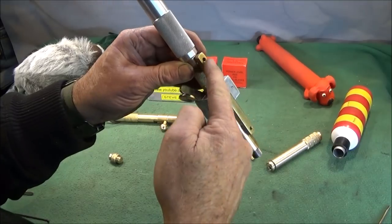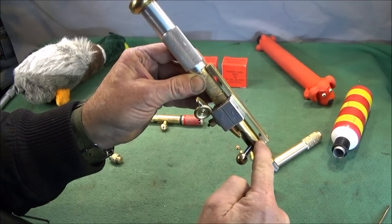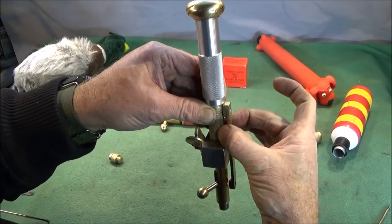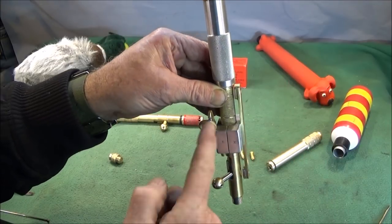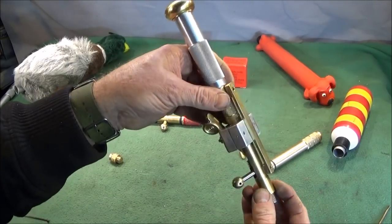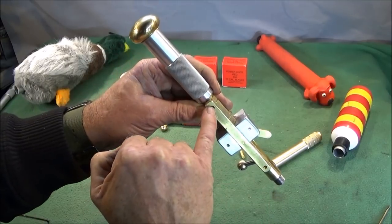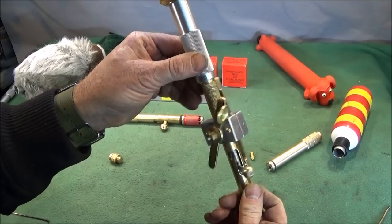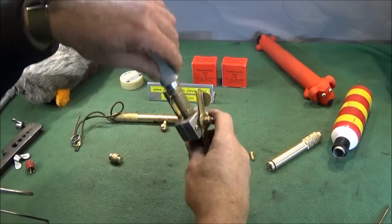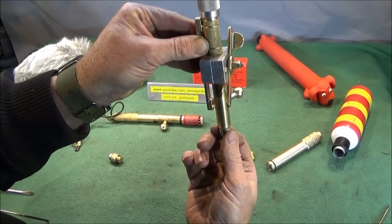So I've put a simple brass bracket on the back of that split clamp, screwed that one on. I've soldered a couple of blocks on each end on the inside there. This is so that when it goes onto a tree or a gatepost or whatever, you can put the zip ties through there and there's no chance of them slipping off. And also, if you want to, when you come to take the trip mine away, you can slide them out from that gap and save the zip ties. I've also put two holes in there with countersunk. That's if you want to use self-tapping screws. And the actual bracket lets the trip mine stand a bit proud, so that you can actually unscrew the